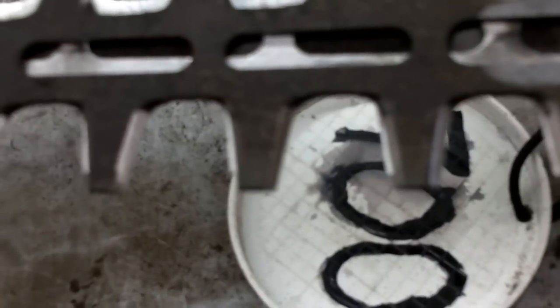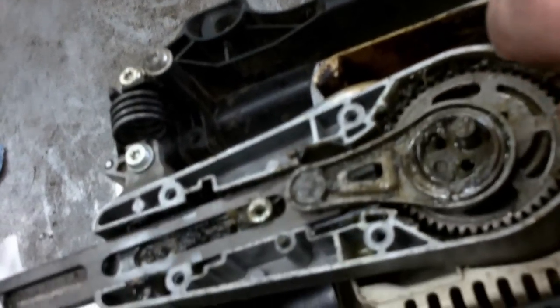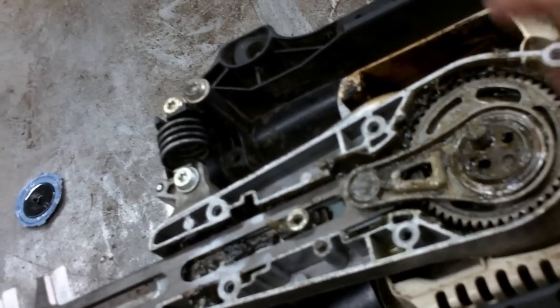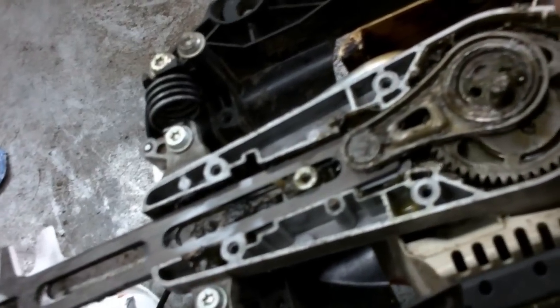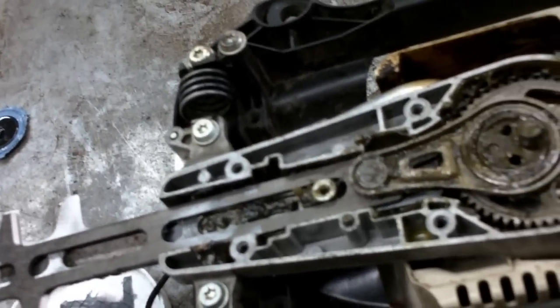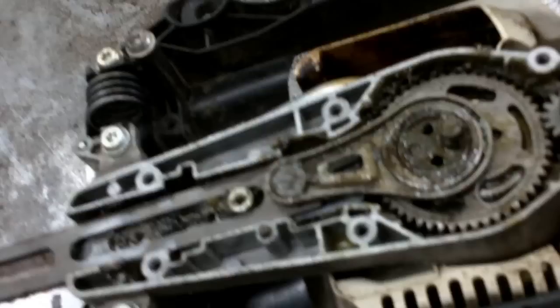Turn it and your cutter should just about disappear. Now, you can't actually get this one out of time because it's a single gear. The Echos — some of them have two gears and you can get those out of time. But on this single-gear model it doesn't matter, as long as the connecting rod is hooked to your blades it's going to be in time. For echo two-gear models, the same principle applies — you want one gear facing one way and the other 180 degrees out. But let me get the top cover put back on.